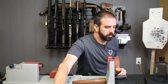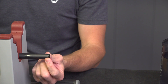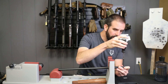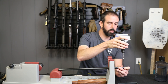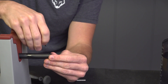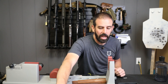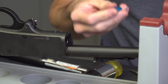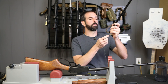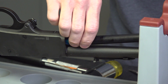I'm going to get the magazine tube — there is a screw in the bottom here and I'm going to remove that screw. It's a simple process, just a single screw running through that cap holding it in place. It's not like the non-barrel-band models where the cap is attached with a stud to the bottom of the front of the barrel. Now I'm going to take my new follower and slide it into the rifle where it goes, take my new magazine tube, slide the magazine spring inside the tube, get that properly aligned in the follower, and slide the new tube down over the follower.